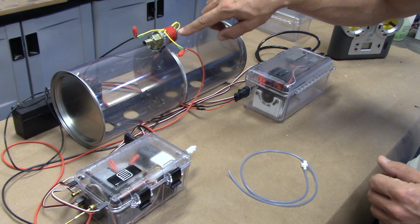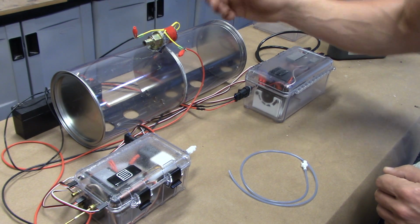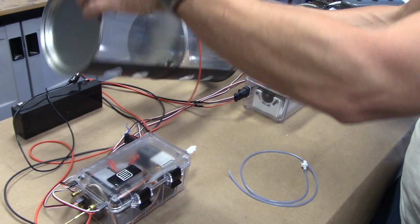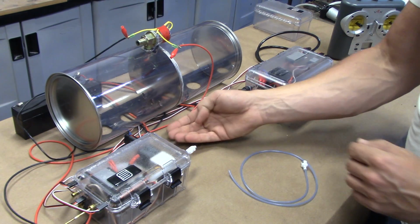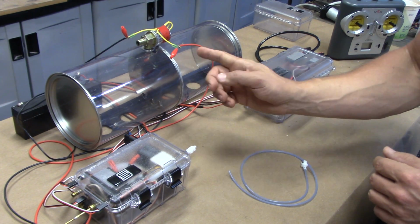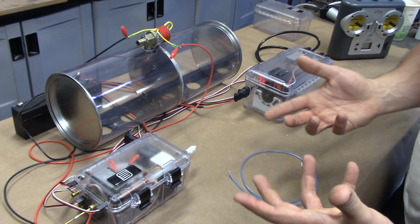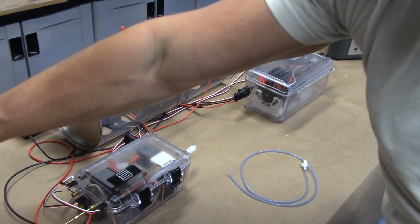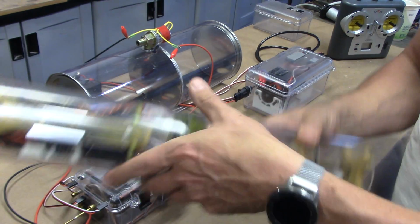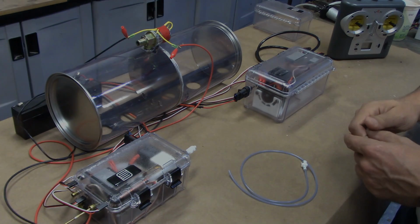Now, it's vented by a 12-volt large aperture electronic solenoid that's been waterproofed. And basically, the bottom of that tank is completely open. You can see some large holes in there. That allows the water to enter the ballast tank when that valve is opened. And there's passages between the two tanks that allow air and water to flow between. So very similar to the previously mentioned Dave Merriman cylinder, that does the same sort of thing. You can see those holes on the bottom there and the vent valve on the top, but this is much larger scale with an electronic versus mechanical vent valve.